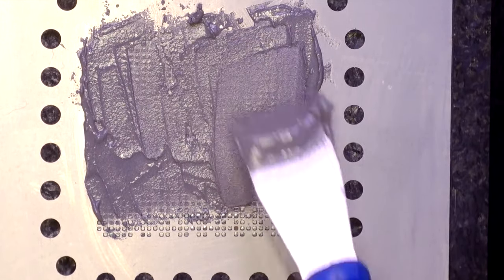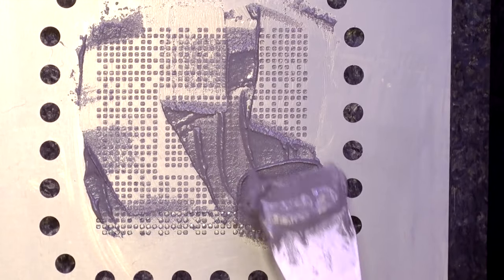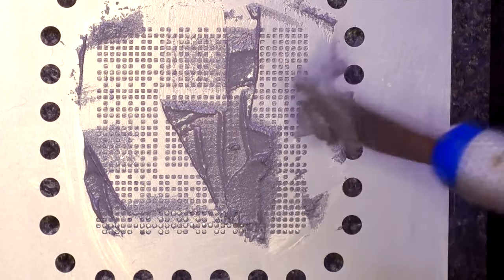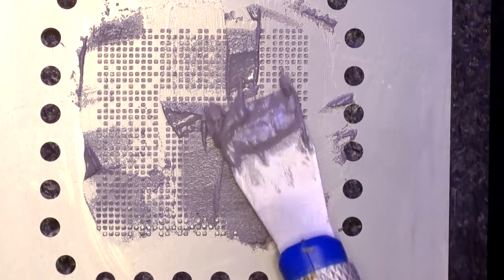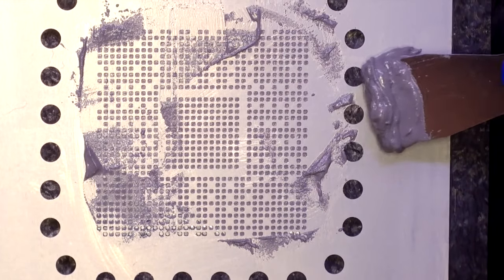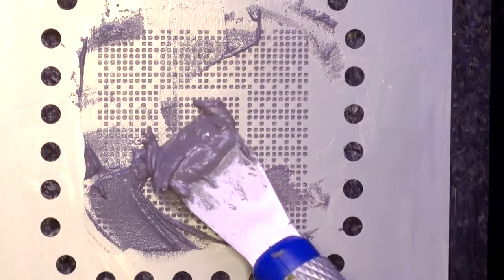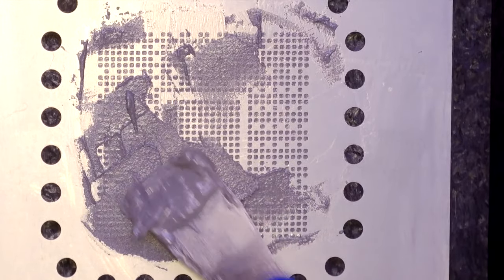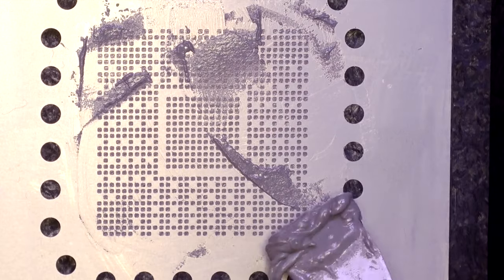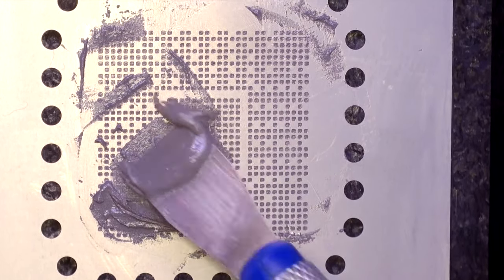You should be as accurate as possible with your stencil and your soldering paste. You should clean up the surface of your stencil to be sure there is no surplus of soldering paste, because it will cause problems if you leave soldering paste outside the holes. Luckily, the vendor also includes a special spoon tool — you can see it in the video — so you can spread the soldering paste into every hole correctly.